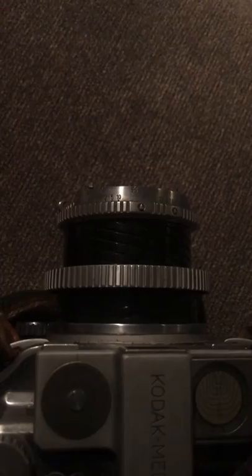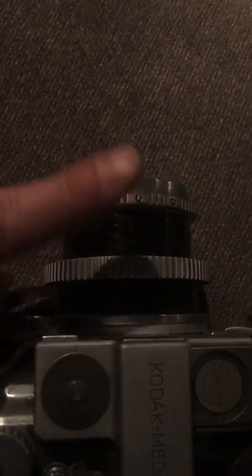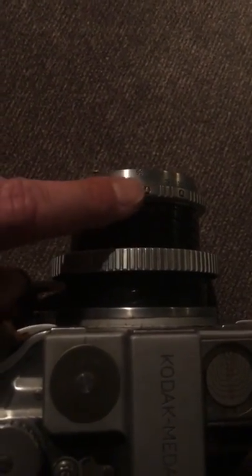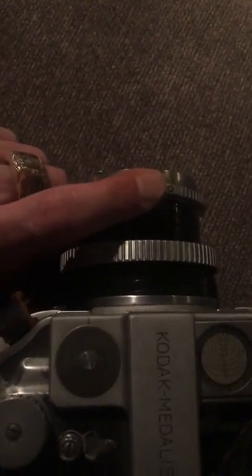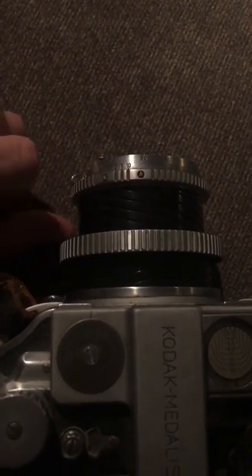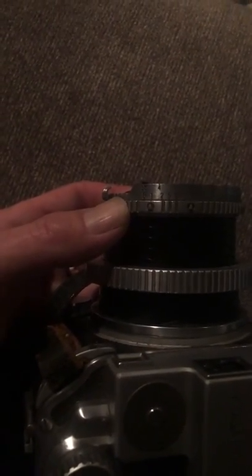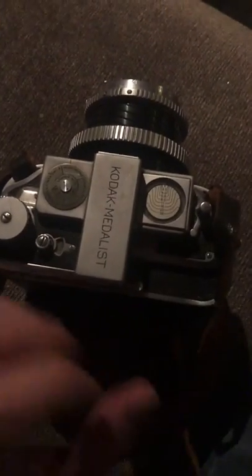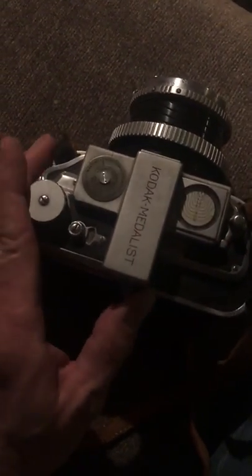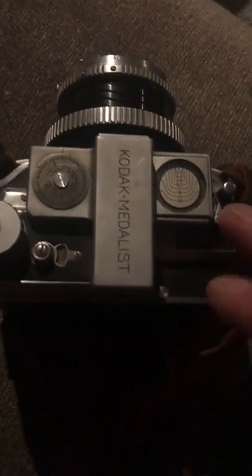For those not really familiar with the Supermatic shutter, you have your indicators, like a Graflex. You have a red arrow for lower shutter speeds, a black arrow for higher. So what we do is we set the shutter speed first. I repeat that. We're going to go to 1. That's the big killer. We cock the shutter on the camera. How we do that is we bring her back, let her release. I'm going to switch hands because it's a right-handed shutter.